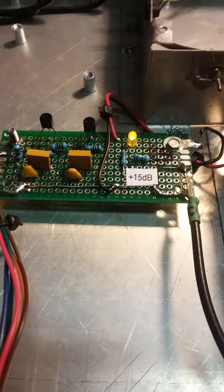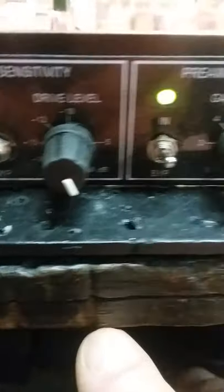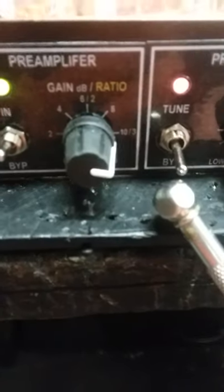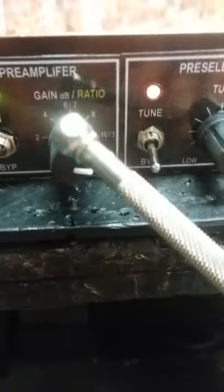This is a very simple but very clean — I like the KISS principle — low-noise preamp with 15 dB of maximum gain, well-balanced 50-ohm in and 50-ohm out. The drive level to the preamp is calibrated. There's a dual-scale readout: dB and yellow for the ratio, so he knows 6 dB is 2-to-1, 10 dB is 3-to-1, and 15 dB is 6-to-1. You won't need more than that.